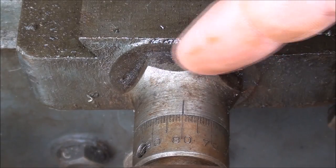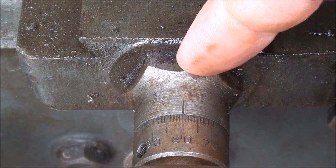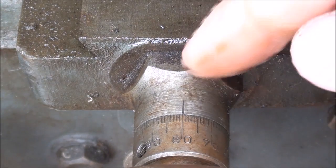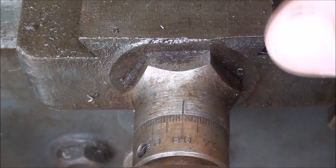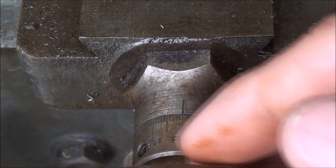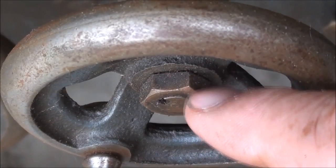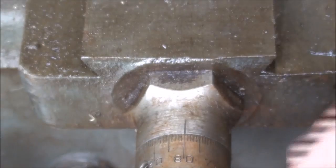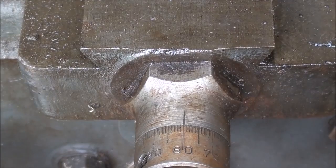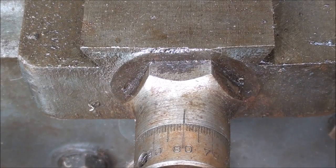I'm not going to replace this part, I'm only going to modify it, and you'll see what I'm talking about in a little while. In order to take this off, all one has to do is put an adjustable wrench on here. After the hand wheel, nut, keyway, and all that is removed, a wrench here will allow you to remove that whole piece and then have access to the screw if you would want to.